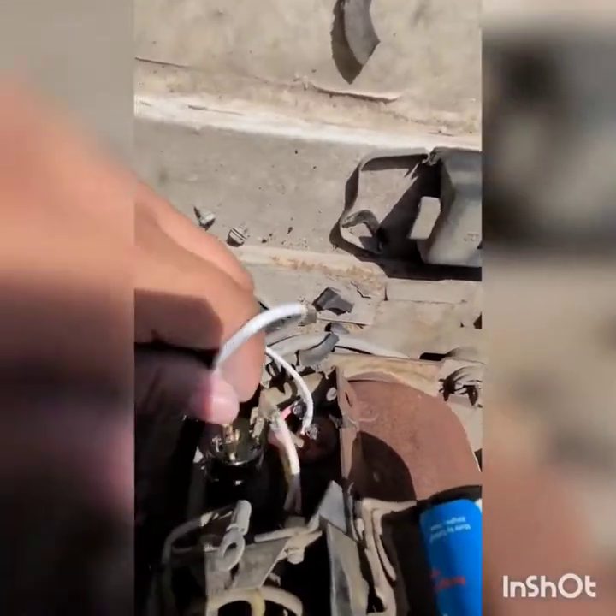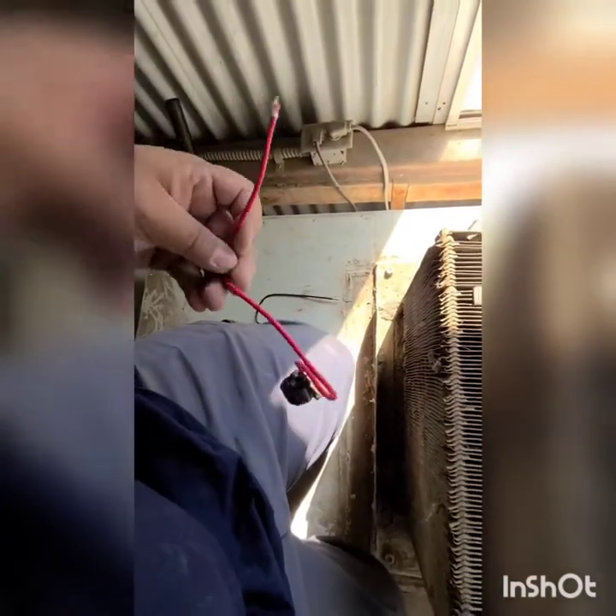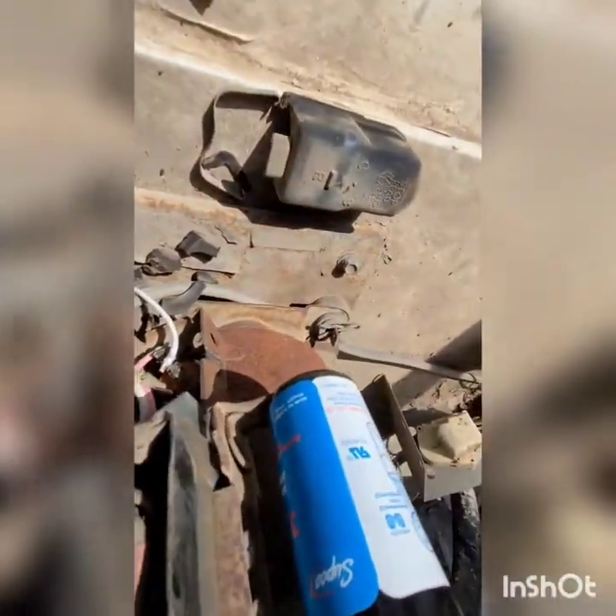This is still in defrost — I've got to work quickly. This is upside down, but basically this is the relay overload that came with the three-in-one hard start. I'm going to place it and tuck it in as close to the compressor as I can. Basically, you're taking power from this white one and it's cutting power to this one which goes to the common. All I'm doing is utilizing the wire from the hard start — the three-in-one. It's got a female connector at the end and the type of connector that slides onto the terminal pin on the other end — perfect, I didn't have to cut any wires. So I'm using the overload, a wire, and the microfarads of the capacitor. I've got my common, my start, and run all connected.